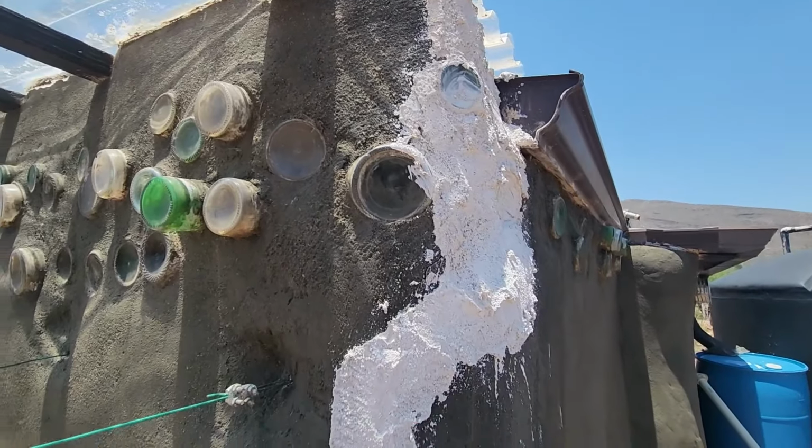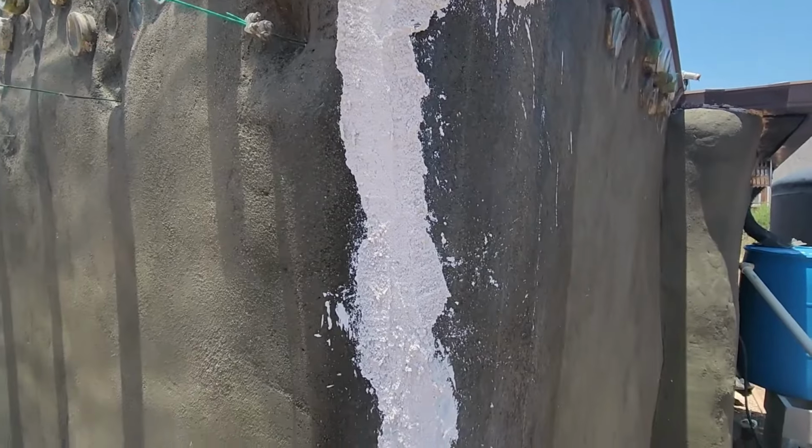So I have this concrete stain that I'll be using for this. I used it for our workshop, which was a cement plaster versus lime plaster. I'm curious to see how it does on the lime. The reason I'm doing the out-of-the-can kind of thing instead of a natural pigment like I did on our pump house is that our pump house has had to be repaired, and now I don't have that exact same mix for the repair coat. So my thought process is, if I get something off the shelf, and I do need to repair this plaster down the road, then I can get that same can and hopefully it'll somewhat match.